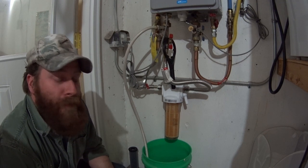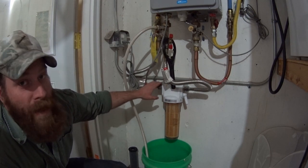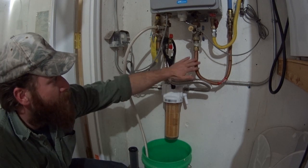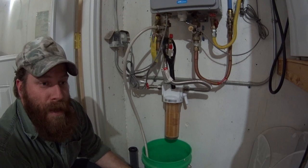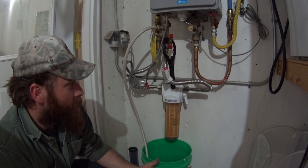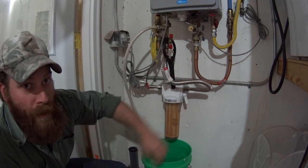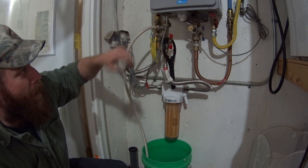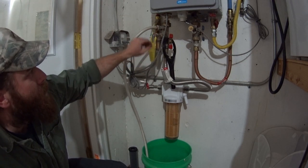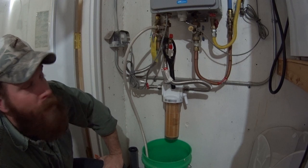All installed and fixed. One thing to look out for that I didn't mention: whenever you're doing this, stay away from galvanized fittings. This is an actual hot water heater connection line — this is also the copper version — but galvanized has a lot of nickel and lead in it. It's fine in other applications but not in a drinking water or potable water source, so you want to stick with brass. The fittings going in and out of this housing are brass; they also have plastic seals to connect to these water heater lines. If you're putting in one of these water heaters in an area that has scaly or hard water, make sure you put in some cleanout ports — that's what these are right here — so you can flush the actual water heater itself. It's a good idea on any water heater, but particularly on these tankless ones.